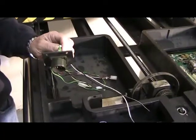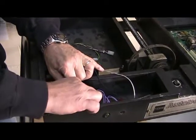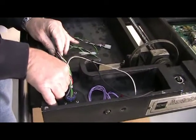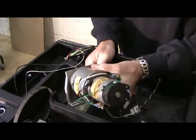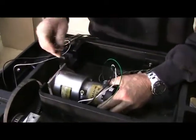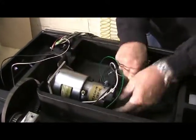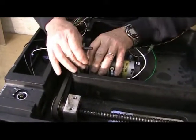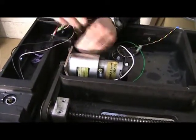Now for reassembly, you mount the AutoMech connector where the Herco connector was — you will receive this back from AutoMech. Now reinstall the motor exactly as it was before. Notice that there is a new encoder provided by AutoMech on the rear of the Herco motor. Adjust the tension on the belt and connect the AutoMech cable to the modified motor.